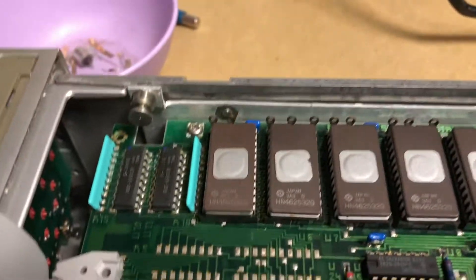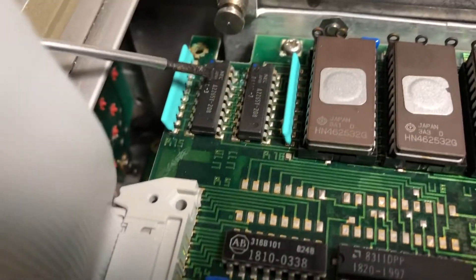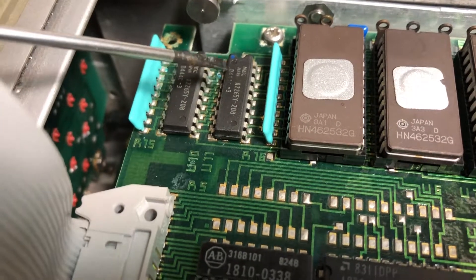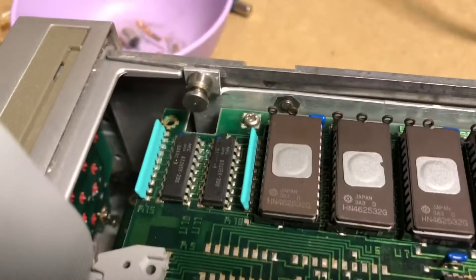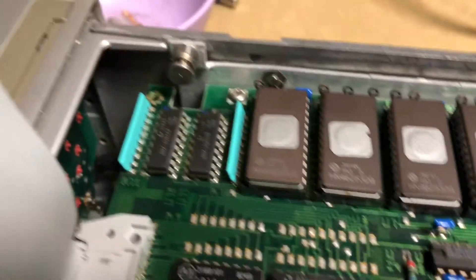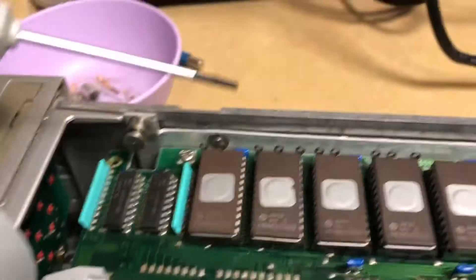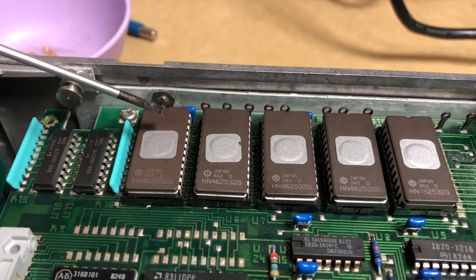So the next course of action: these RAM chips are NEC brand, looks like a D444C. The manual specifies what kind of RAM chip and memory size. I've ordered two of them - found a pair on eBay that were pretty cheap, they should be arriving today. We'll put sockets in - these are 18-pin packages. In the meantime, one quick thing we can do is take out the ROM chips and see if we can boot the unit.